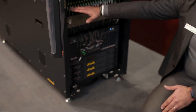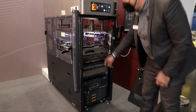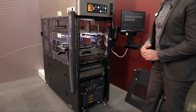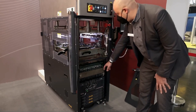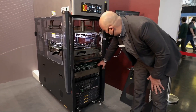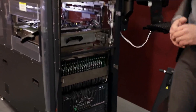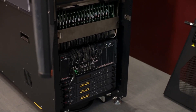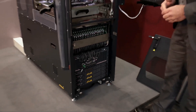From the upper side, we have what we call the analog pin cards — those are the test pins that are connected to the fixtures. We have 20 of them, and each one has 128 test points, which makes the system capable of testing 2,560 test points. Towards the right side here, you have the SMH programming card with two programmers for this demo specifically. But eventually with the system, you can program up to 160 channels in parallel using the i7090.